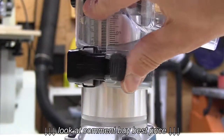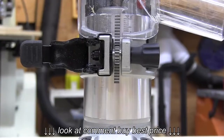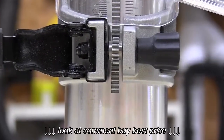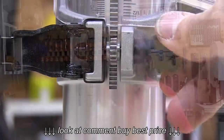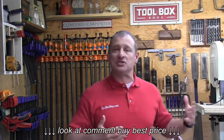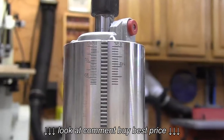Next to being cordless, the base adjustment really excites me. Makita uses a quick-release cam lever to adjust the fixed base and the plunge base, plus a micro-adjustment knob. I love how Makita designed in that rack and pinion depth adjustment, which lets you really dial in precise settings. This is a smooth, fast, and super easy adjustment that frankly blows away the competitors'. The aluminum housing also has etched imperial and metric depth scales.